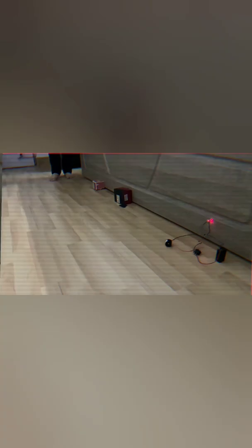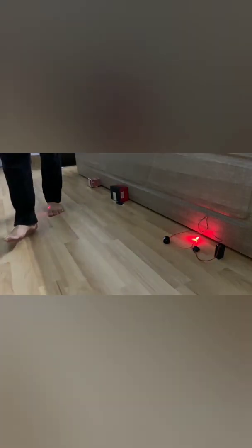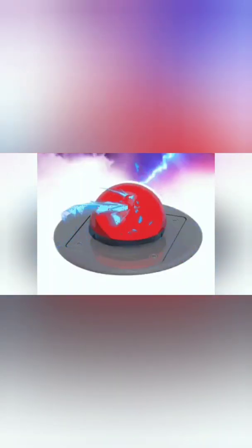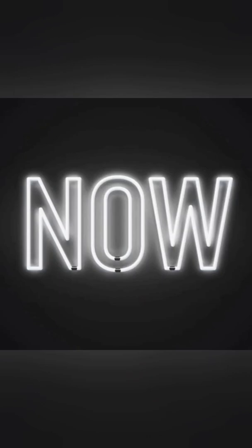What happened back there? Let's check it out. When a person walks through the passage crossing the mirrors, the path of the laser ray gets obstructed, due to which the LDR gets activated and sends a signal to the electric buzzer, which in turn responds by producing a loud beeping noise, thus alerting that someone broke in.